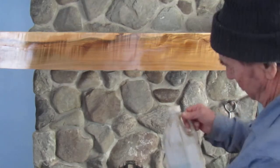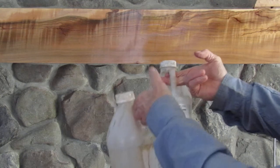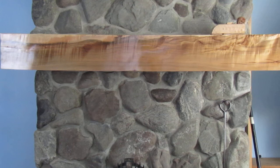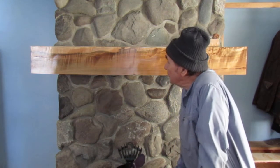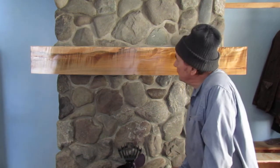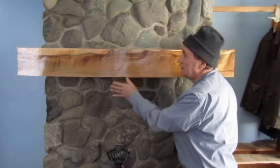Here's the epoxy resin that I used. It's Epoxy 80B. There's two different ones — a hardener and the other solution. You mix them together 50-50. The directions tell you to mix it for two to three, five minutes, and you really do, because I tried the shortcut method once and it didn't work. So you have to go by the directions. You mix that resin up, pour it into the cracks, let it set, and sand it off.